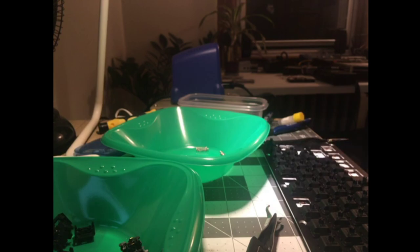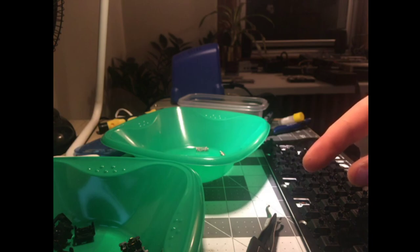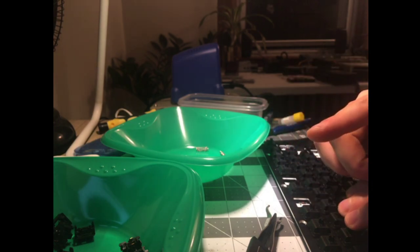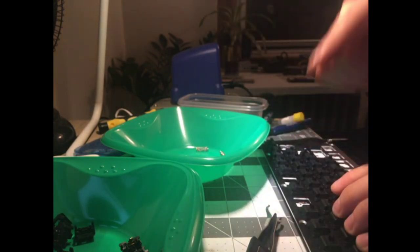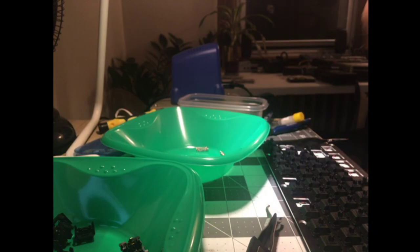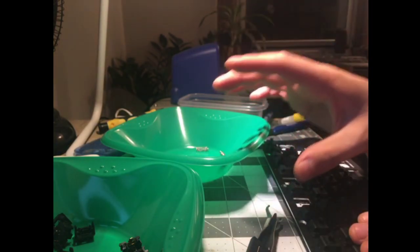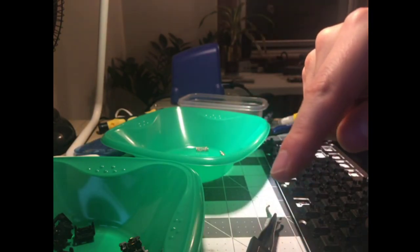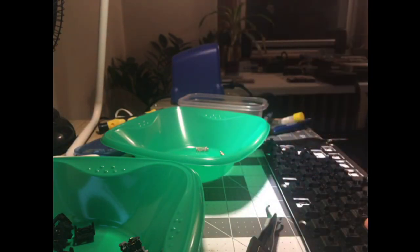So what I ended up doing with them is I took the sliders and I put them in Gateron linear housings, Fay housings with milky tops. And no, that's not true. I actually got cherry tops and put them on the milky, whatever. I used the milky tops or something else. And then I took the 3204 lube sliders, and I just reapplied 3204, and then I put them into the Gateron milky top housings. And then I took the Gateron sliders, I dry lubed those with isopropyl and PTFE powder, and I put those back into the cream housings. And those are very different, but I feel like I've finally gotten my money's worth out of those switches.